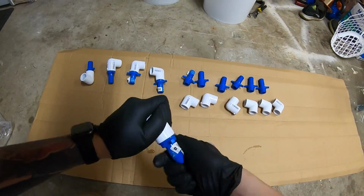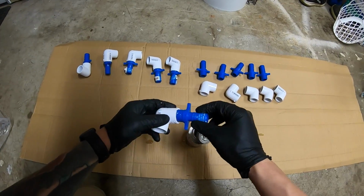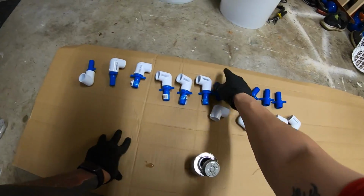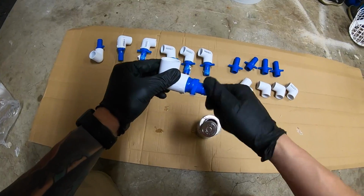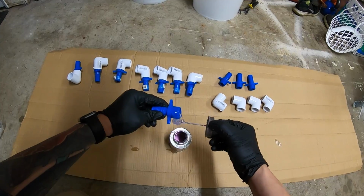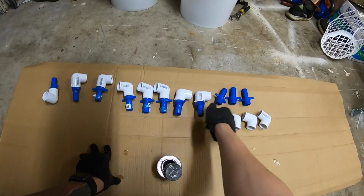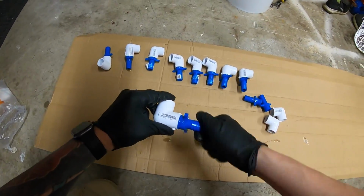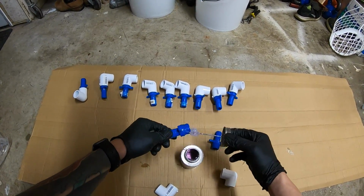Now I bring up that they're 59 cents because the other ones that I used for most other tanks, I use these Everbuilt hose barb adapters, 3/4 inch to 3/4 inch, and those are found at Home Depot. And these suckers are like $4, so they're kind of an opaquish, whitish, clear color. That's what I thought was all that was available that would actually hook up to these 3/4 inch PVC elbows that were threaded. And come to find out, I was wrong. I just went a little bit farther down the plumbing aisle, found those things, and they work. So you're able to get so many more. Was it like 10 for the price of one or something, some nonsense like that?